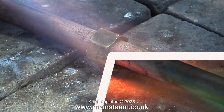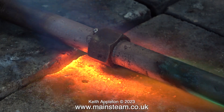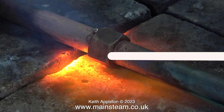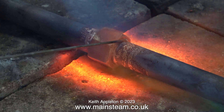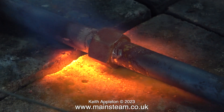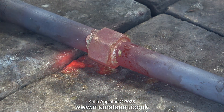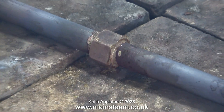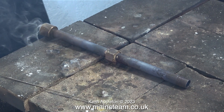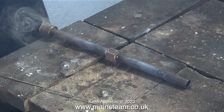It took quite a while to get this part to the temperature needed to melt the silver solder. What I generally do is deposit a blob of silver solder on the work, and when this dissolves into the part I can apply some more and the job's complete. Please be aware that this is not a quick job — the video has been heavily edited and is running at twice normal speed. After applying the solder, I make sure it runs into the joint, leave the heat on a bit longer, then turn it off. I'm not going to quench this because it doesn't fit in my water pot. In case you're wondering why it's smoking — this blast pipe was fitted to the engine and it's the remains of oil inside the blast pipe smoking from the heat.